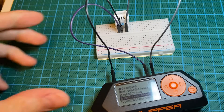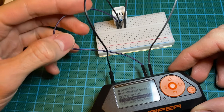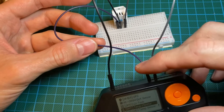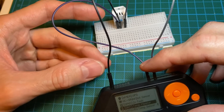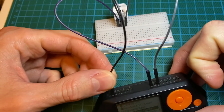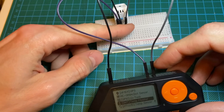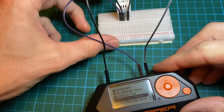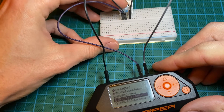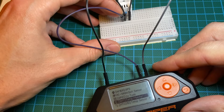I have used this breadboard to make a simple wire where I'm using pin 1 from the DHT sensor and it's using the 3.3V on the Flipper Zero. For the data port as pin 2, I'm using pin 2 as well on the Flipper Zero side, and the ground on pin 4.